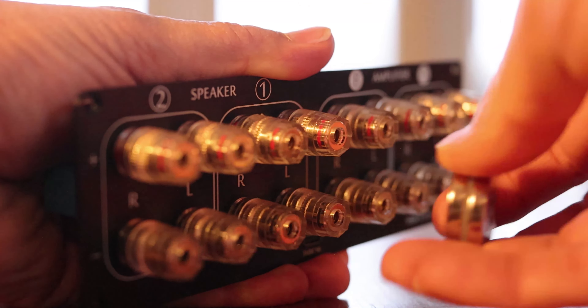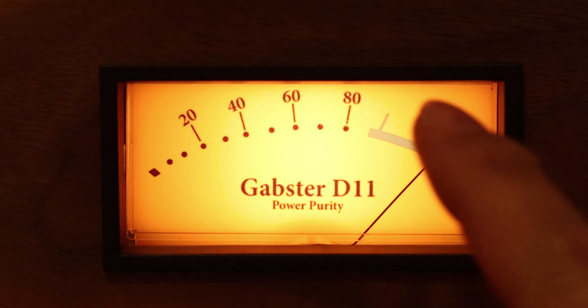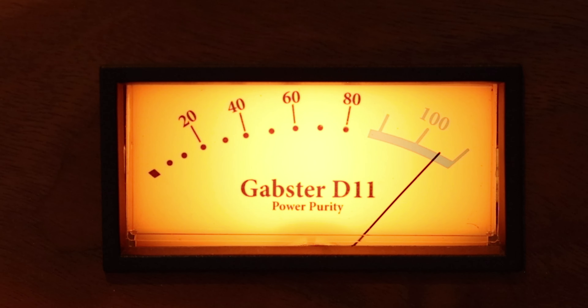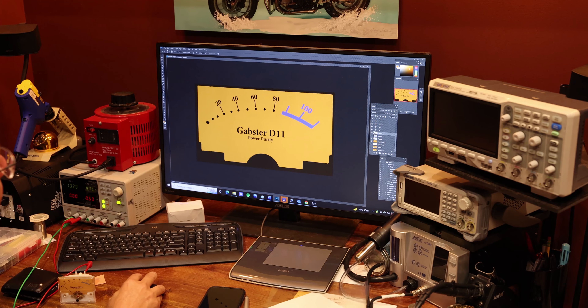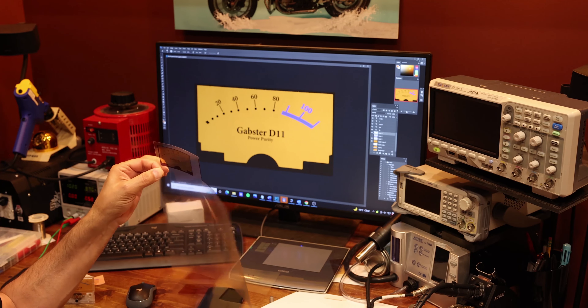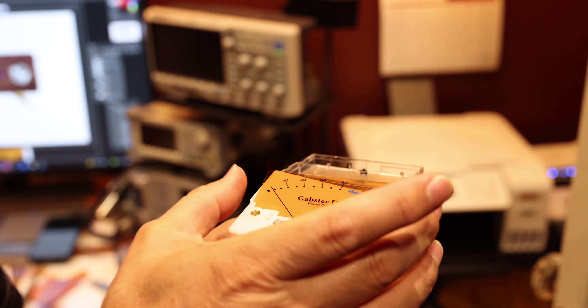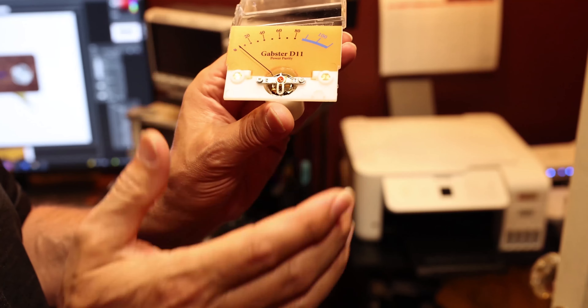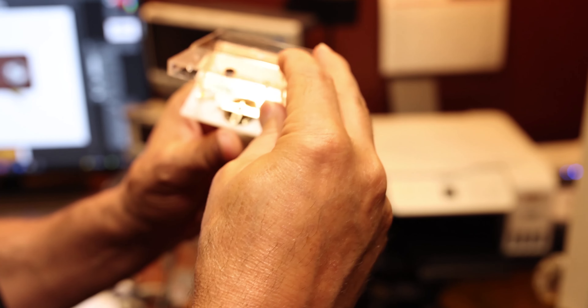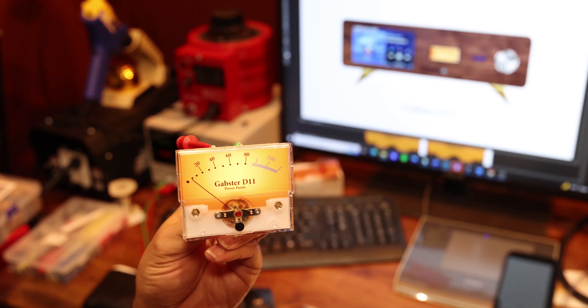I tested the chassis with very strong neodymium magnets — it's not ferromagnetic at all, which is really good. The entire chassis is aluminum, so there are no ferromagnetic parts. Now, remember when I mentioned you can customize the VU meters with your own logos and graduations? I'm going to show a clip of how I did that — I designed a face template for the VU meter, printed it on transparency paper, cut it out, and replaced the original VU meter faceplate. After cutting about six or seven attempts, I finally got a precise one — there are quite a few little cutouts and you have to be exact, but it works fine.